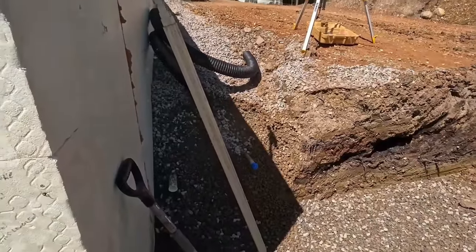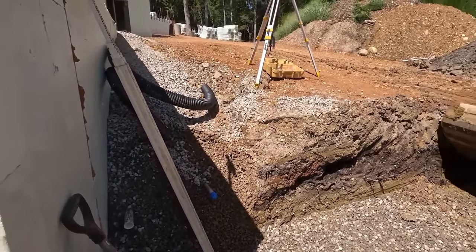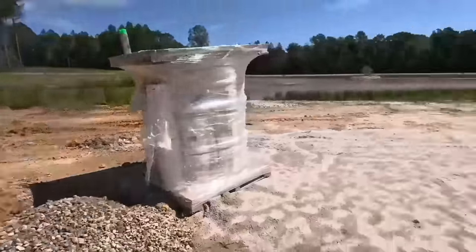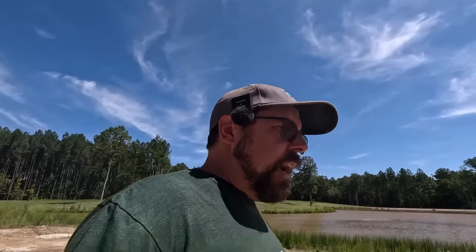Need to get something to cap that off. And when he builds the wall, I'll just core drill wherever I want something. I did figure out that was easiest. I know there were a couple people who said that. It's just easier to drill later where you need something, because number one, you can't remember everything you're gonna need. Number two, it's never in the right spot. And even if it's out by a quarter inch, sometimes that matters. So better just to drill it.